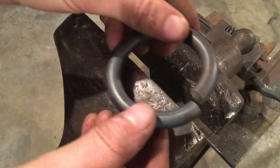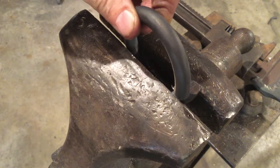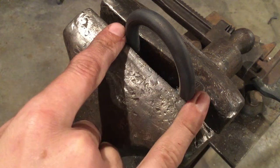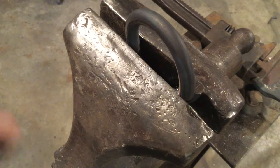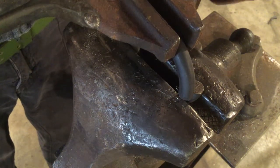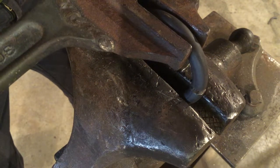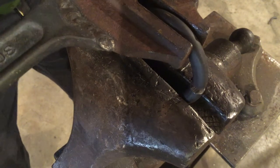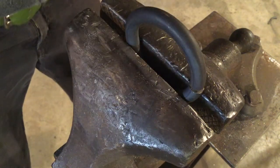One more time, we're straightening this over so you have a good view of what's actually happening. We're clamping at the midpoint between the helix cut and the back of our O-ring. Then grab the twisting bar, get a grip on the top of that O-ring, gently apply pressure, go slightly past the bending moment so that when it deflects, it's on center with that O-ring.